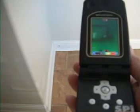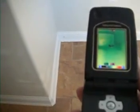Infrared scan of the building. We're going to be looking at plumbing points first off on the ground floor. There's no real insulation on the top floor, but there is on the ground floor. Let's see if we can focus it. Okay, yeah, so there's a confirmed leak at the hot cold water faucet for the washer. There appears to be no leak behind the wall. Okay, that's good. We'll have a look in one of the bathrooms.